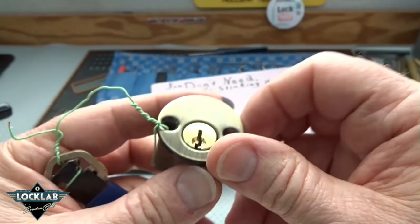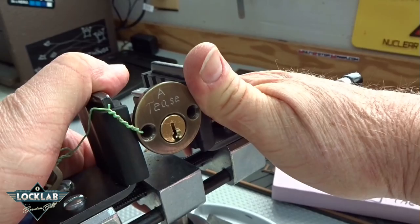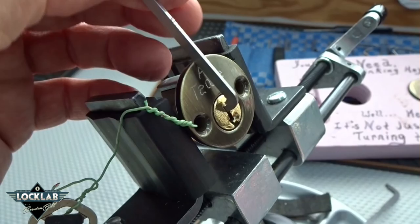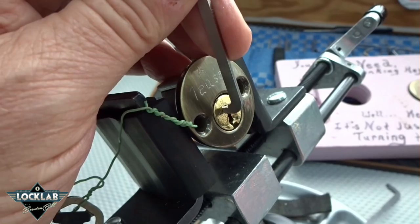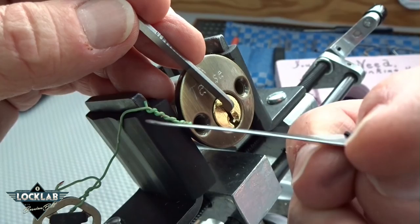I was working on another lock. Let me tilt that back a little bit so we can both see it. I'm gonna try the top keyway. I'm gonna try to pick it counterclockwise — seems to come a little bit further, so maybe we've got a false set already. I'm going to use a standard hook, 25 thousandths — this is the one Ref Tattoo made for me, and it's nice and wide, fits in there pretty good.